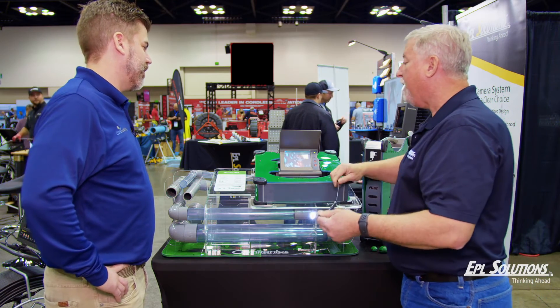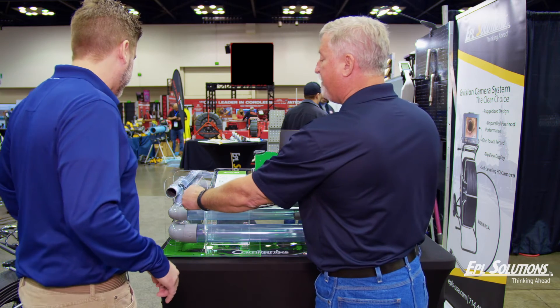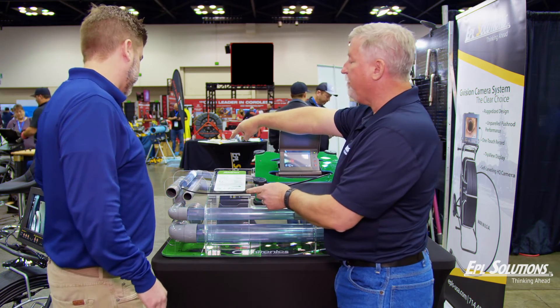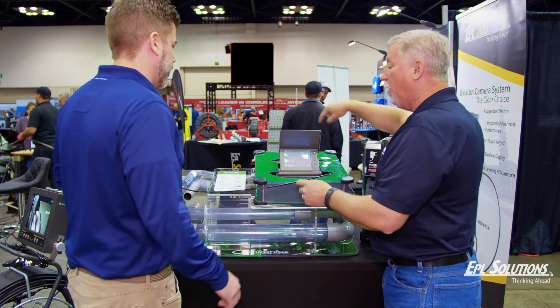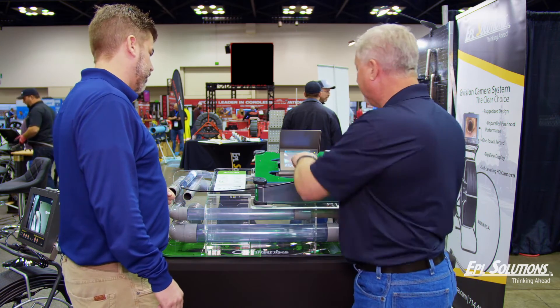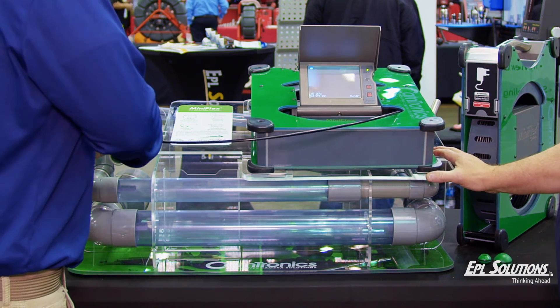What I want you to do is go through the experience of what customers do. I have a one-inch PVC pipe and I've got a one-inch 90, and there's another one-inch 90 here. In this configuration there's a total of 17 feet. Let me just zero myself out — there's nothing but 90-degree turns here.